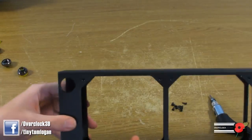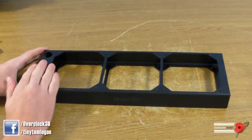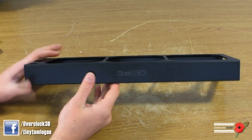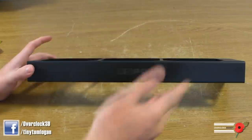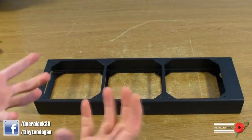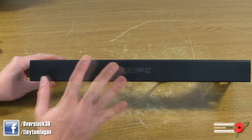Then you have the outside, which is aluminium. So you can sand it all down. This is anodised as well, so you will need to sand it down — you can't paint straight over the top. You have to sand it back. Where it's aluminium, don't forget to use etch primer. I personally prefer separate etch primer and normal primer rather than the self-etching combined type. You etch prime it because the acid etch eats into the aluminium so it sticks properly. But acid etch will react with a top coat, so you then have to cover it in normal primer as well.